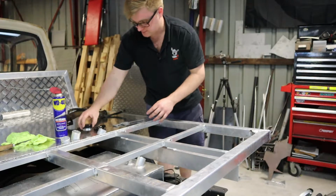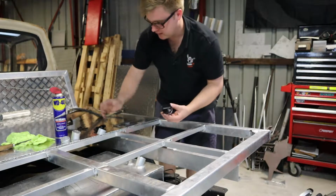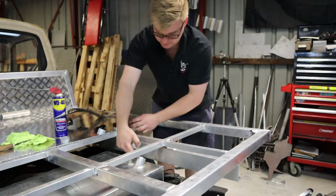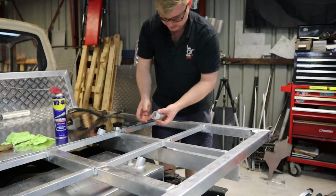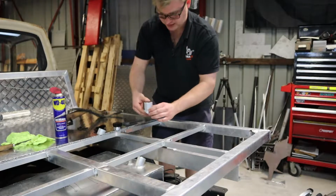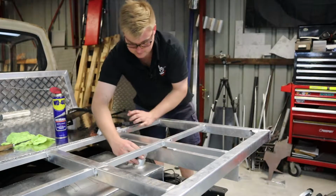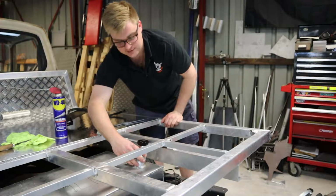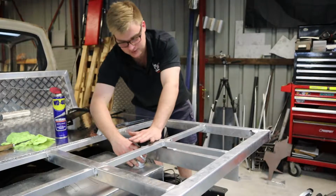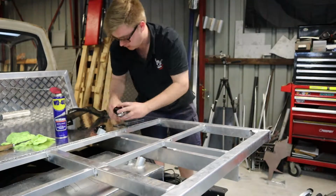So this is a little Aeroflow weld on filler cap, and then just chopped up some tube the same diameter as the stuff that's on the fuel cell. So it's going to bend up or weld up a couple of elbows. That'll sit something like that, nice and flush, and it'll be like a little door or something that'll open here to allow you to fill it up.